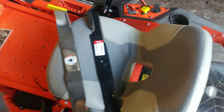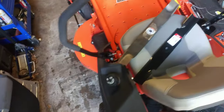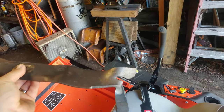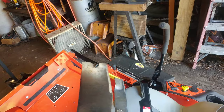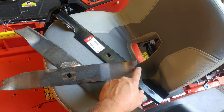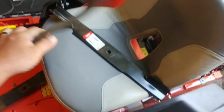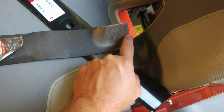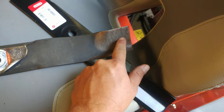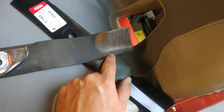This is my brand new machine and it's got 25-something hours on it, and this is what the blade looked like at 24 hours — just completely wore down and actually lost a piece. You can see what happened here: the sand sandblasted right here in the middle of this lift pad. Right in this area seems to get the brunt of the sandblasting, it just wears through.